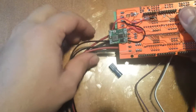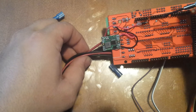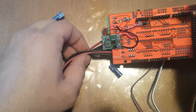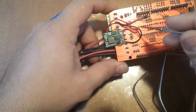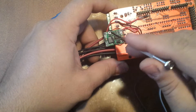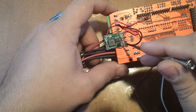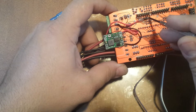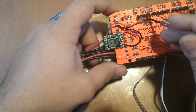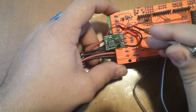The other thing I used is a step-down voltage converter. I found this online, actually in the RAMPS forum — so this isn't my idea, but it's a great idea. It'll handle up to 26 volts and steps it right down to 12. I'm actually using this to step it down to the original diode that I removed and placed back on underneath, on the downside this time.